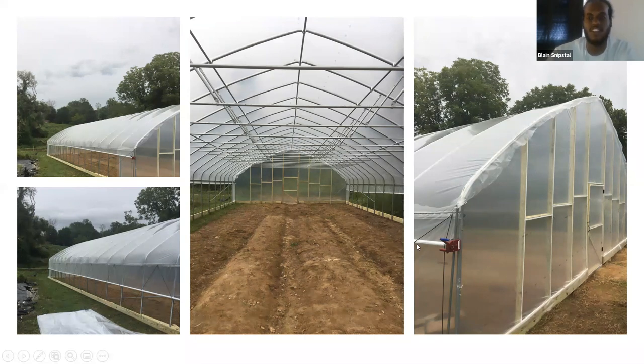And installing the roll-up sides, that's a very simple procedure. The instructions that come with that are super simple. One thing I didn't show is that on these baseboards, there are eye hooks, or technically eye screws. You need to install those almost exactly 3 inches from the top of your baseboard. The reason you want to do that is because your roll-up bar is roughly 1.75 inches. So it's about 1 3/4 inches or so.